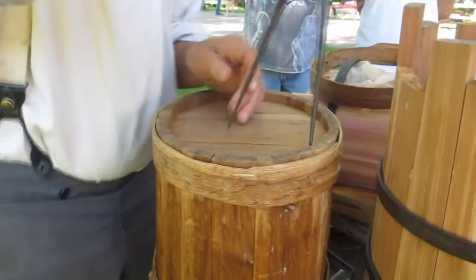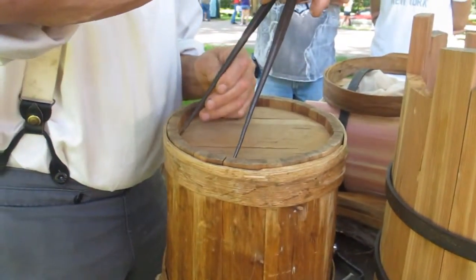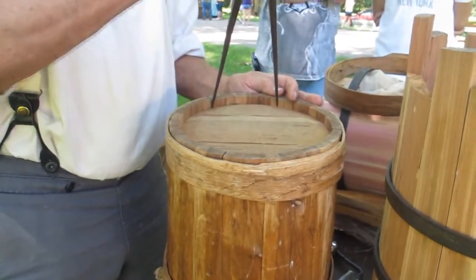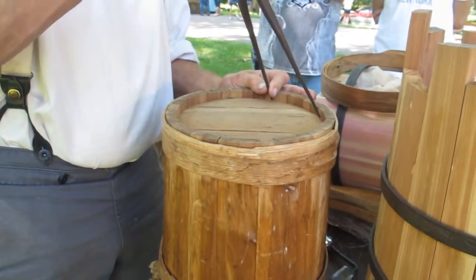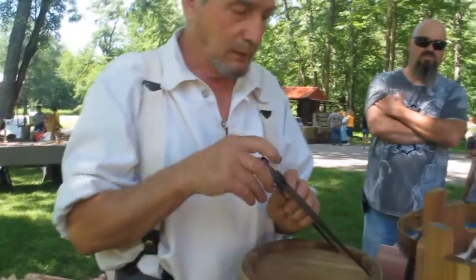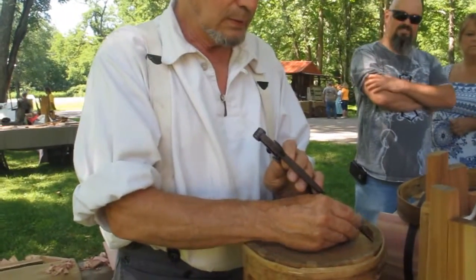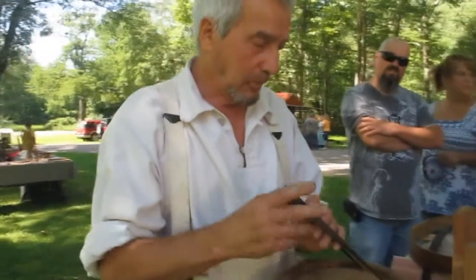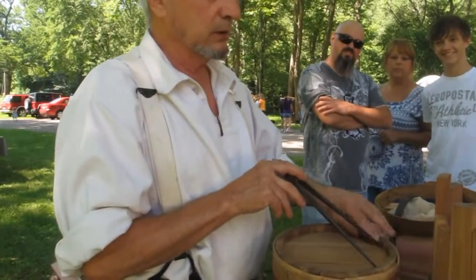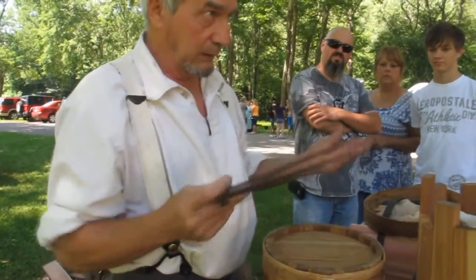1, 2, 3, 4, 5, 6. I'm a little long. So I just simply adjust back 1/6 of that distance as a guess. And I do it again. And again, if necessary, until I end where I began. Then thusly that becomes my radius. Okay? Equilateral triangle.